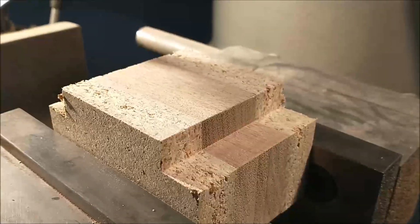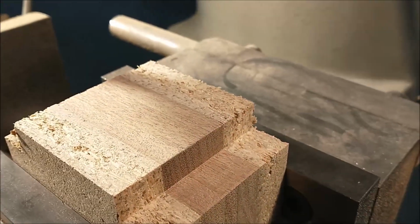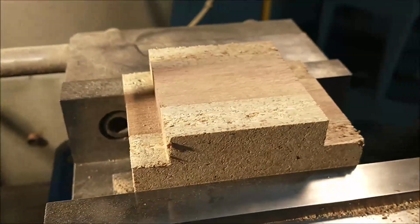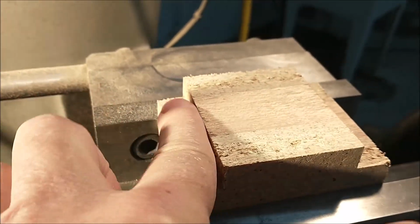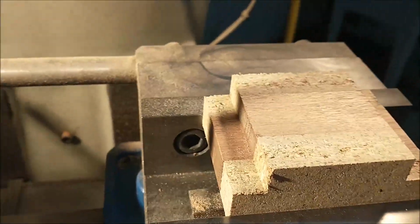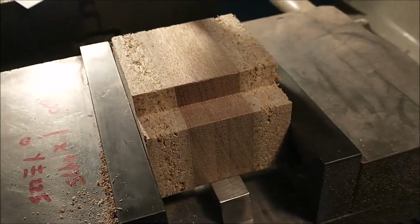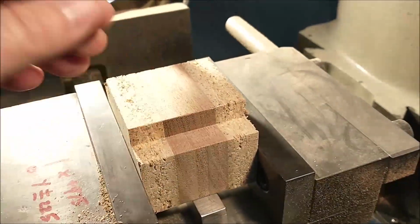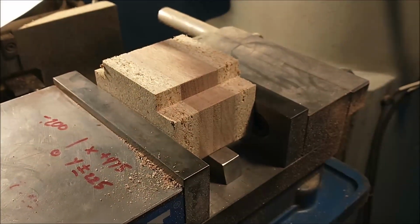In an honest attempt to keep the back sides of these pieces from blowing out, I've sandwiched this with some particle board, and I'm treating it like any other material. The chassis is inverted, and these are the notches where the square axles will sit at assembly. Now, if you haven't figured out exactly what I'm doing, I'm making the halves as one unit, and I will split this down the middle on the bandsaw and bring these to final thickness in the final operation.